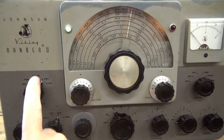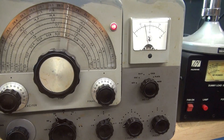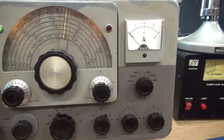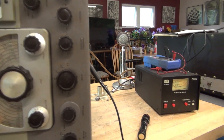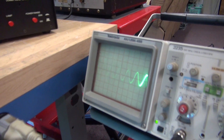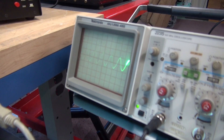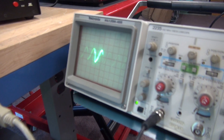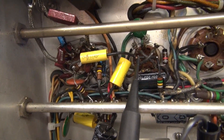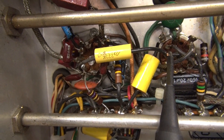While monitoring modulation, if I flip the switch to phone, I'm drawing excessive modulation current. And if I go to phone and turn up the audio, it's going down, indicating that we have some type of oscillation or DC getting into the preamp circuitry. I hooked up the scope to the output of the 12AX7. Watch when I turn up the audio gain and when I flip it to phone — there is the oscillation. It appears to be low frequency, so I'm wondering if the filaments are getting into my signal. Somebody has changed the preamp tube socket and recapped that area. I'm wondering if they were chasing this oscillation to begin with, so I'm going to look real close and make sure everything got connected properly.